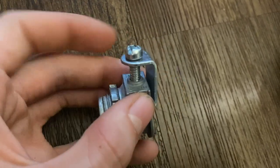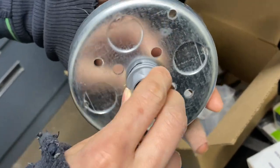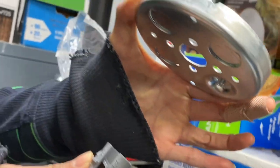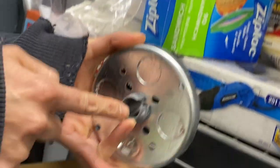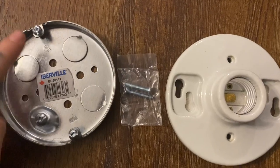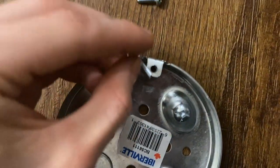You'd need cable connectors to bring a build up to code. Here my boss explains how they work: they fit right in, you install it, screw it onto the inside, the wires come out of it, and there's a stop — once you feed the wire through it wedges so it doesn't move. Also, the screws that come with the mounting bracket aren't long enough, but the lamp holders come with longer screws for this reason — just replace the smaller screws with the two bigger ones.